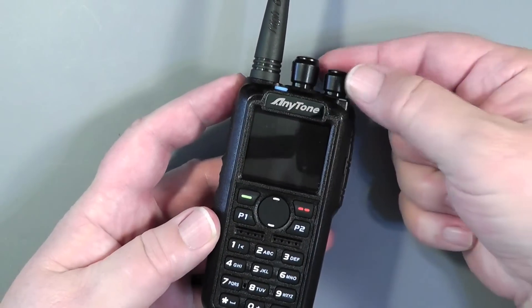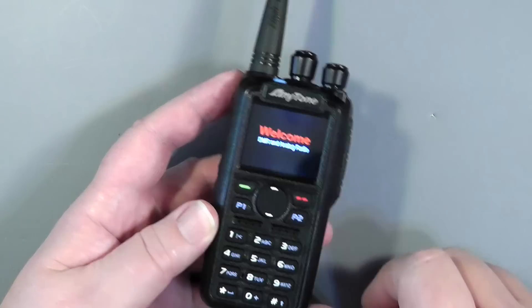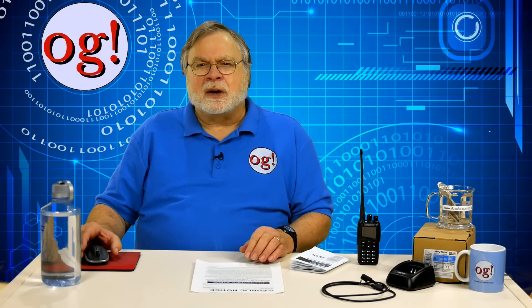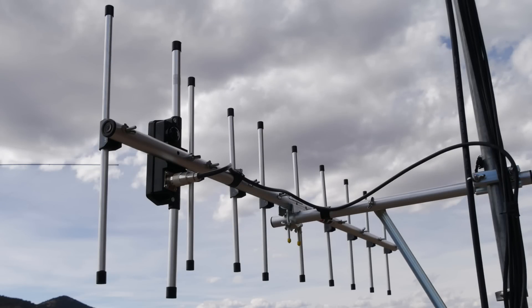So, let's talk about using the radio. One odd feature is that after you turn it on, you have to wait about four seconds for the screen to show anything. Be sure when you put the radio down after turning it off that it really is turned off. My personal thinking is they ought to put up a splash screen immediately upon power on. The audio quality is okay, but note that DMR itself can cause poor audio quality if the link is poor. If you hear digital sounding audio, it may just be that the radio link is poor. I used the radio via my 10-element 70-centimeter beam to work the Grand Junction DMR repeater, W0BX.